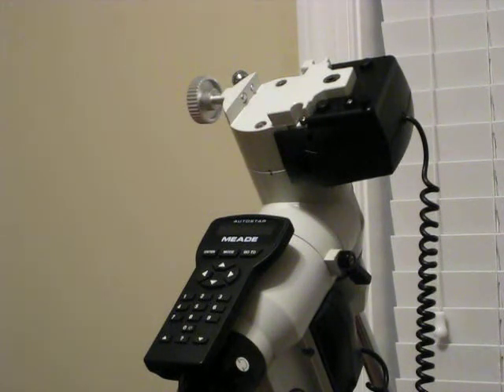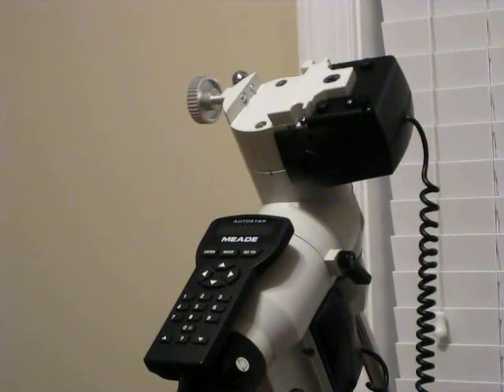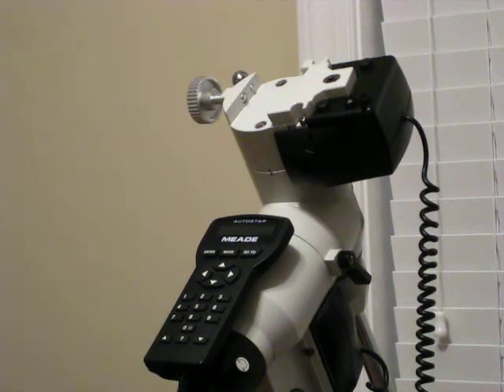The reason I got those covers was more or less as a space filler — they took up some of the length on the screw, making it just right. I had about a quarter inch or so of screw sticking out of the bottom that needed to screw into the motor housing. Those covers were about $1.20 for a pack of two, so about $5.00 total. You can see the housing is nice and secured again — it's not flopping around. I just tightened the screws down on the outer side of the housing. The buttons give a good diameter on the outer part to give the screws something to pull against and tighten up the drive box.